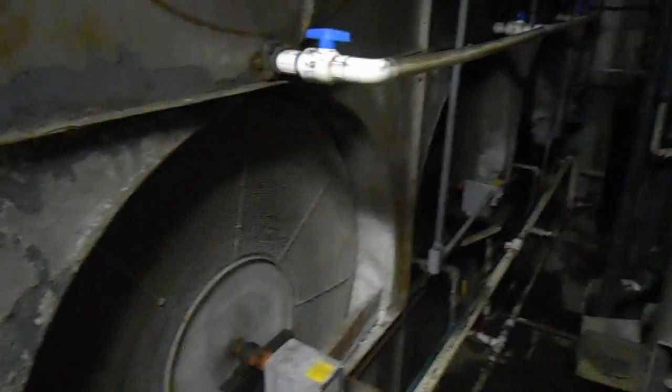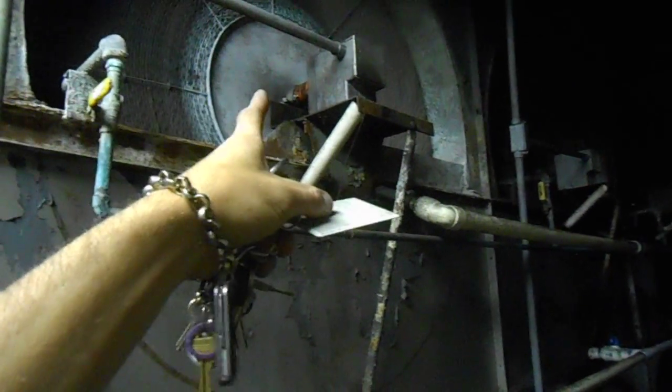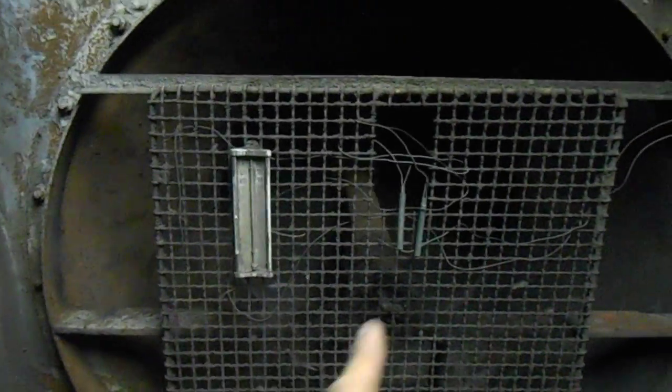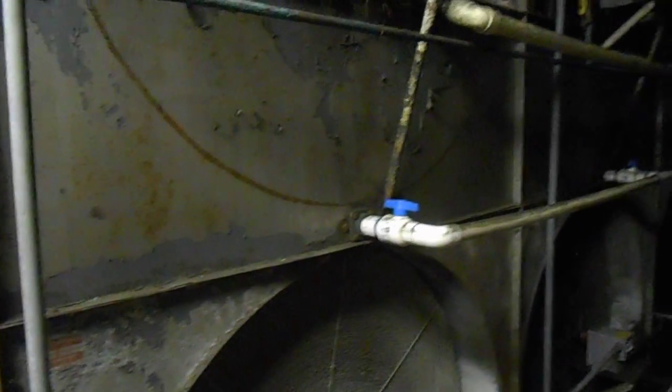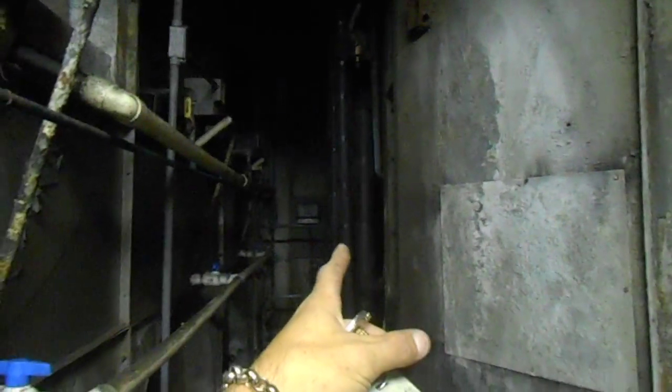These, my friends, are the water wheels. In Utah we don't have a lot of humidity, so this is the early form of cooling. They were bringing that outdoor air through. These water wheels have water running through them — that basically adds moisture, cools the air, and that cool air is pulled into this blower. That blower then shoots it through and down into the building. This system will pretty much maintain building temp up until mid-June. Once we start getting over about 90 degrees, these are shut down — you don't want to run humidity into a system at the same time we're running the DX chiller. So when the chiller starts running, these shut down.